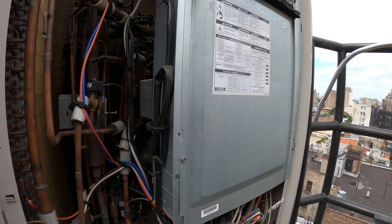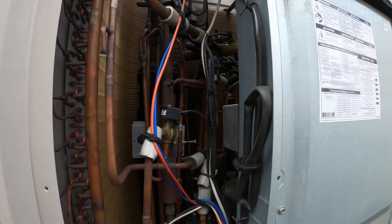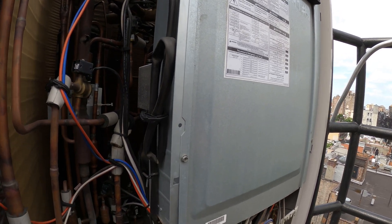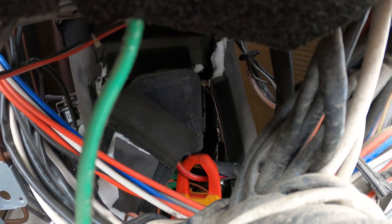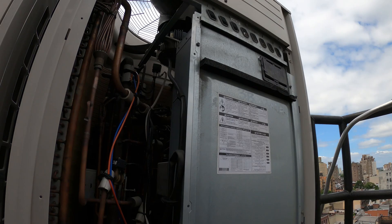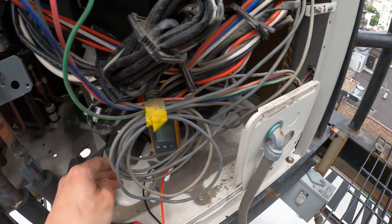This building has been plagued with faulty compressors. Pretty much for the last three or four units that had this issue, it's been a compressor changeout with the inverter board. So before getting heavily involved with checking boards and pulling panels, the first thing I'm going to do is grab my amp meter. Power is currently off. I have my amp meter across one of the three wires for the compressor — this is a three-phase DC compressor. We're going to give this a reset, and I need to give it about five minutes to de-energize.